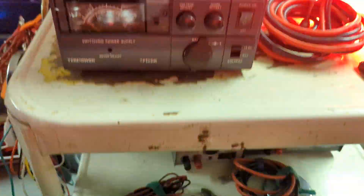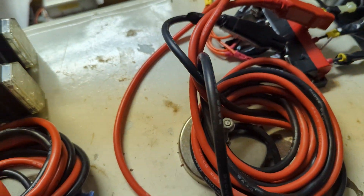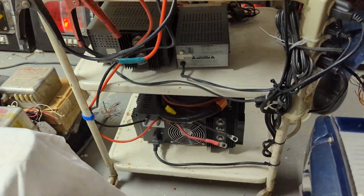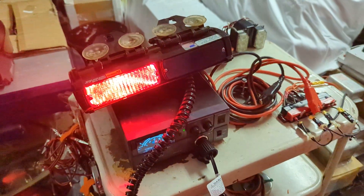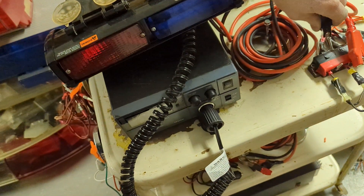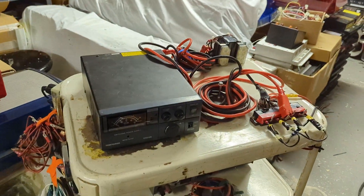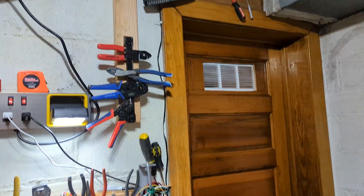The high amp alarm is pretty angry. When you clip the power clips in their home positions, if it were to be turned on, that would trigger the alarm — a safety reminder that if I've been running it hot and walked away, it's still on. I had to pull the black lead, the negative lead, off the home spot in order to use the cigarette plug. Overall the cart's worked out pretty well, though I would have liked some better wheels. The bottom power supply is high amp and heavy.